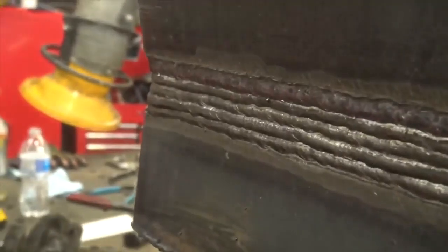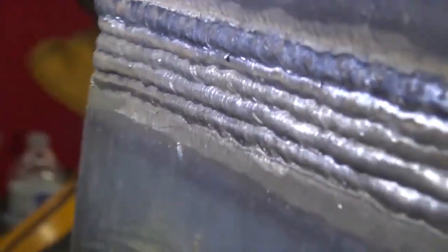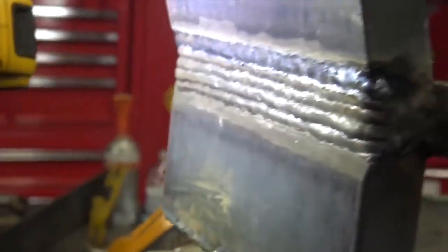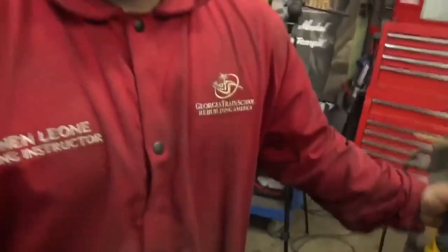One, two, three, four, five stringer cap. The main things you want to look for: no undercut, edges to be clean, no trapped slag — always scrape your spatter balls off. Always want to make your plate look presentable before you show the employer you're testing for, or your inspector, instructor, anything like that. Try to keep it tight, keep them tied in — no slag, no undercut, not over an eighth, not underfilled. Wonderful. Thank you for demonstrating for us, Mr. Steven Leone. Anytime — links in the description.